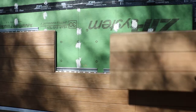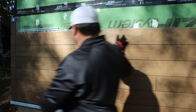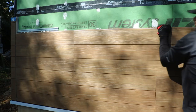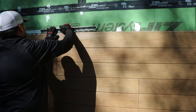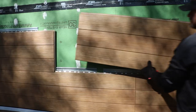With the installation of the first panel on the next course completed, continue installing panels by repeating the same installation steps, making sure to fasten a joint tab with each panel on that row. If you are having a little trouble seating a panel down all the way, grab a wood block, place it on top of the panel, and tap lightly with a hammer. Fasten the panel with an Ultimate Clip and Joint Tab and continue installing panels down your row.